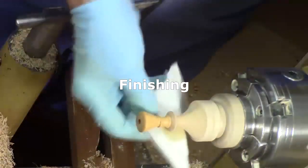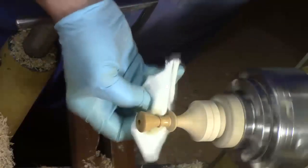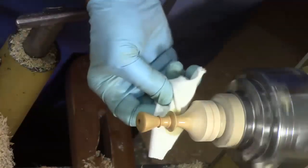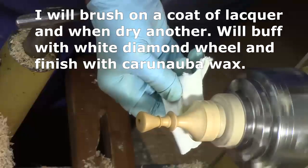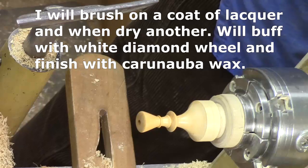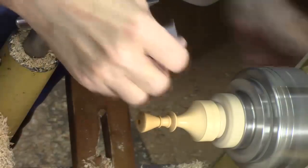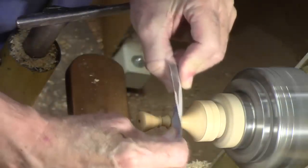To finish the Bradford Pear pieces I'm putting on a little lacquer sanding sealer. I've sanded it up to 320. I put this sanding sealer on — it dries very quick — then I'll sand it back with maybe some 400 grit and on to 500 grit. By the time I get back with a piece of sandpaper this is going to be dry. Notice how I come over the edge — you want to keep crisp edges on all the details.